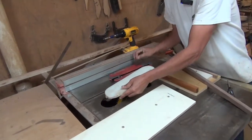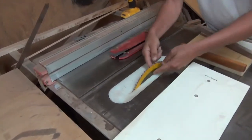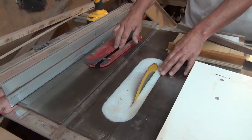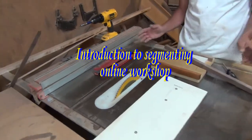What I've done is made a zero clearance insert — it has zero clearance there. I keep it on most of the time just because that little gap gets really dangerous anytime you're doing thin cuts of any kind.